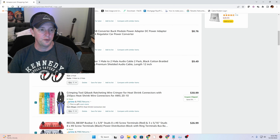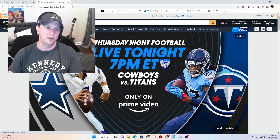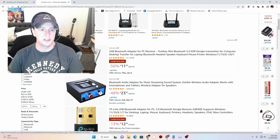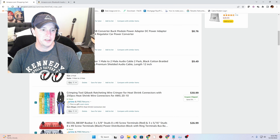So what these two RCA splitters are for — I'll just go ahead and show you the Bluetooth adapter. It's actually this one. If you notice, it's got RCA outputs. We're feeding both a front channel full range and a subwoofer input as well. So we're going to come off of this Bluetooth adapter with these Y-adapters and feed the inputs to the amplifier — one set to the front channel, one set to the subwoofer channels.